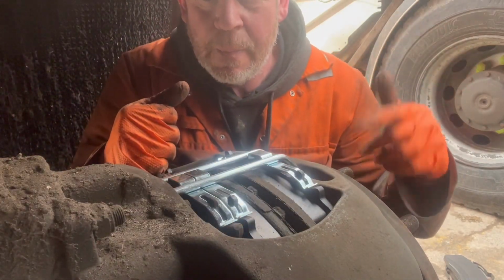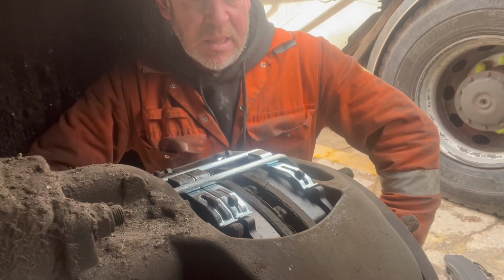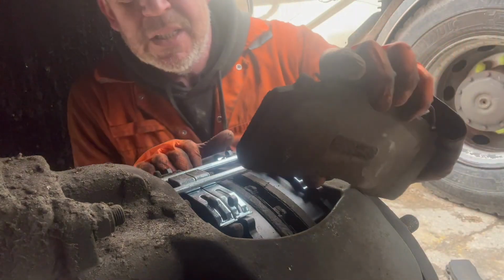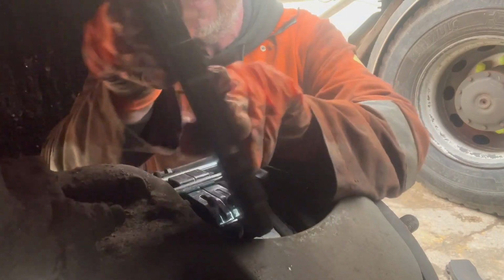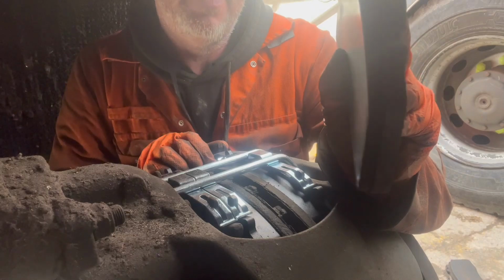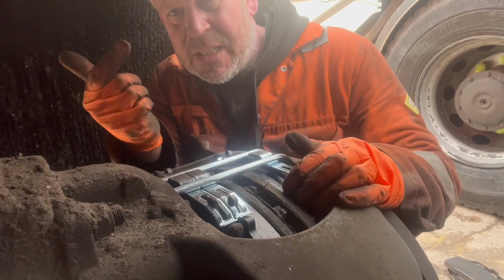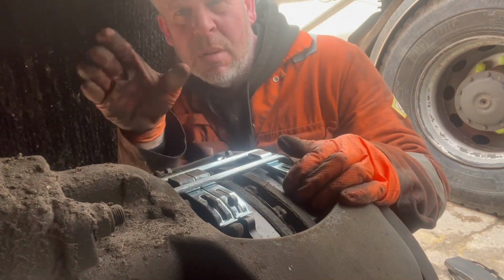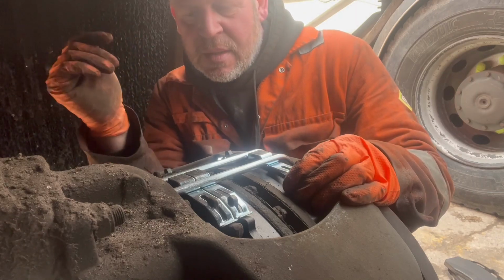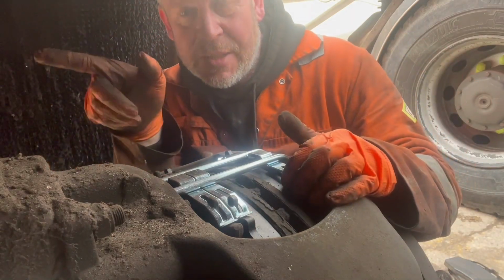So what we'll do now, front wheel back on, top wheels up, take jacks out, and hopefully it shouldn't be so bad. Now then, look at these pads on this side, look how much meat's left on them. It's criminal, isn't it? I don't know if you can see that on camera properly or not. Yeah, you can. They're like 70% one, something like that. Look at that one pad on the other side, which seems to all broke up, and the lining is coming away. I'll show you more detail in a minute, but I think that might have been the issue, to be honest with you.